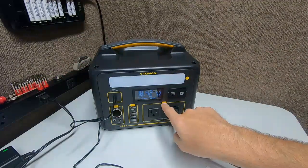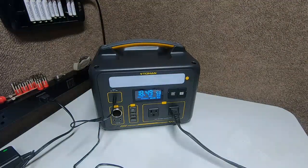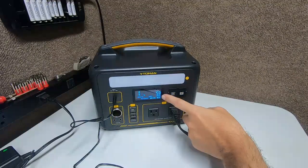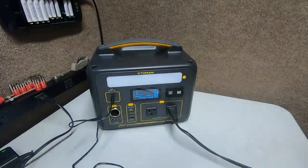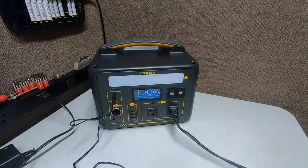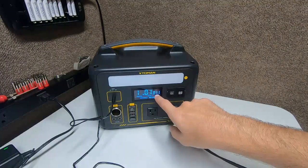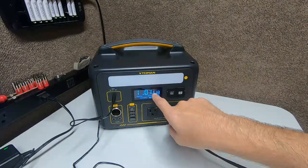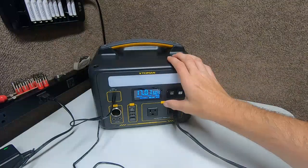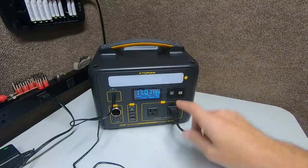So if you turn on the AC, okay, it'll go through its startup, and then like I said, remember that's a 1200 watt heater, guys. Let's watch real close on camera and see if that 4th number even lights up there. All right, so that's 1200 plus watts. Notice it got to 7.9, I saw 9, but I didn't see all the way to 12. That heater usually spikes all the way up, and now it's resting back to its original state of 600.